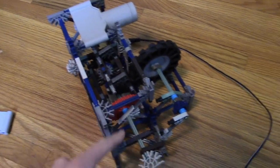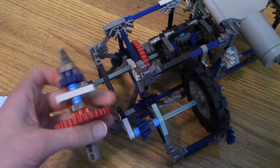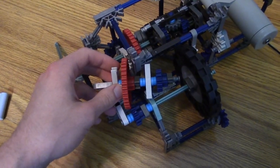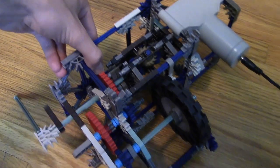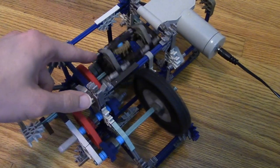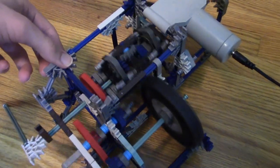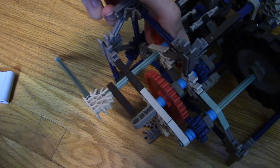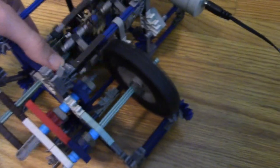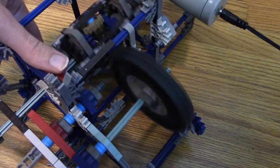So to cause a more smooth ramp-up time, I decided to add this flywheel right here, and this hooks up to the gear on the differential. Here is when everything is locked down and the output is going at the same speed. However, when it needs to slow down to let the other motor catch up with it, we can just unlock this gear right here. And you can see that the differential had a slow startup unlike all the other systems. And because the differential started up slower, that makes this a lot smoother transition between being on and off — and that's all because of this flywheel. It has to gain momentum when it starts, but once it starts spinning, it just stays that way.